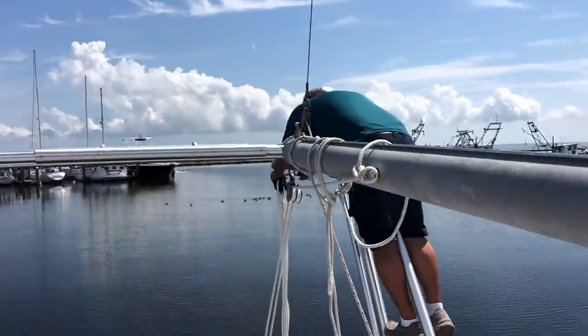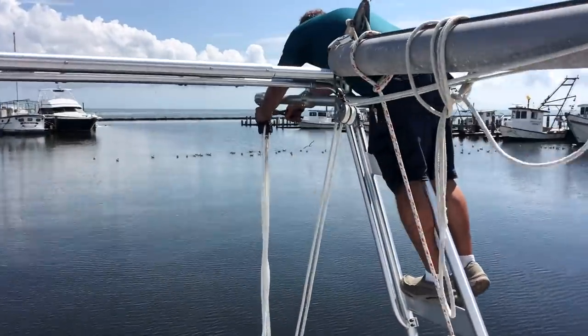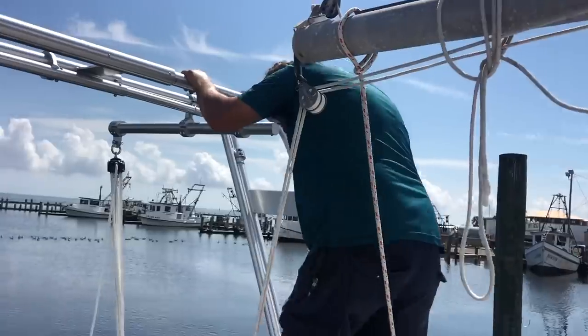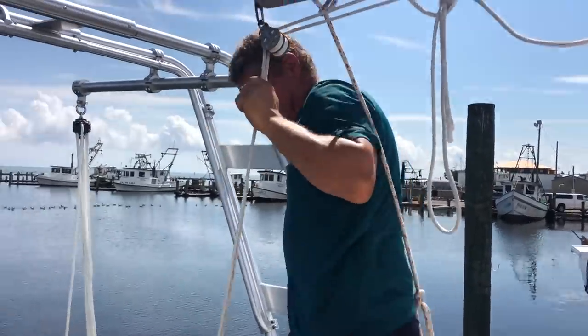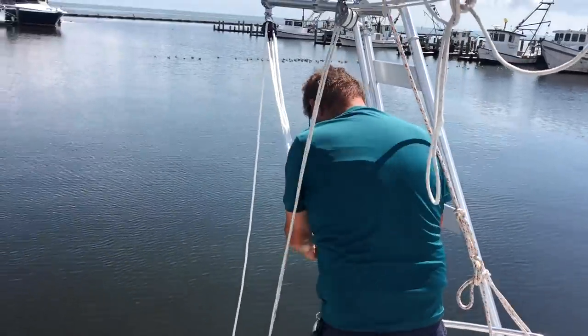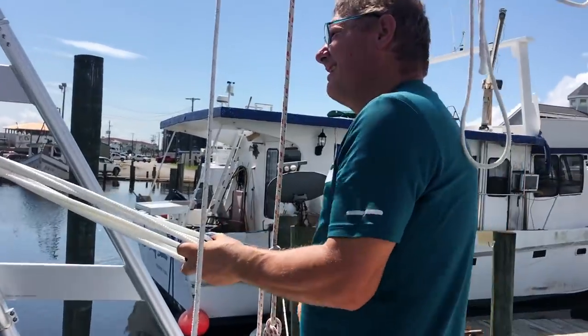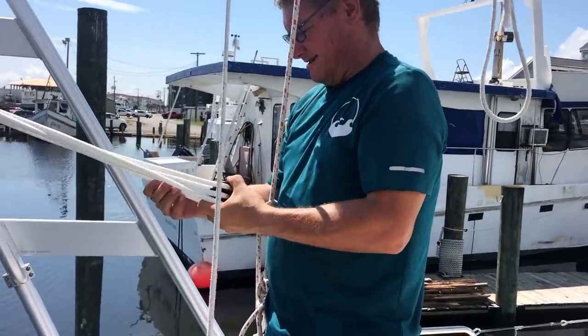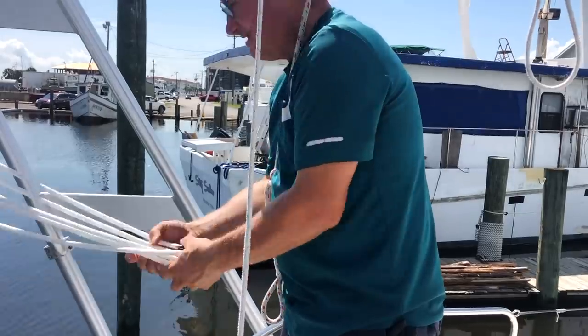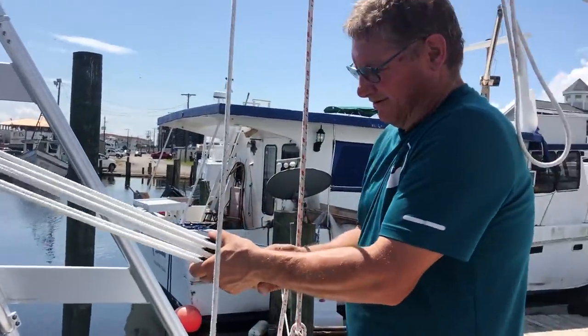We purchased the optional davit system for our Sea Admiral Uni Arch from Fish on Sports. Lifting the boat and motor out of the water would require a block and tackle and a lot of rope. The more pulleys, the easier it is to lift a lot of weight. We decided on a Harken 6-to-1 purchase with a cam cleat on top. There we go.